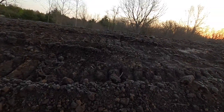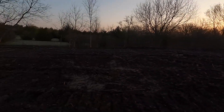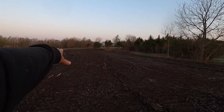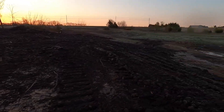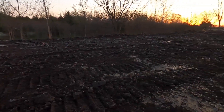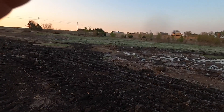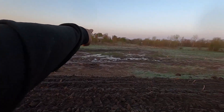I was hoping this stuff would be frozen — it is fairly frozen, not real wet. As you can see, here's the top of the dike — he's already taken a good couple feet off of it. We want to take a good portion back; it might actually be graded where it's kind of lower, but we want to pull probably six, eight, maybe ten feet out up here at the end. Then they're going to push out the pond back here, move all that dirt up this direction, and get all this elevated, kind of coming down to the pond with fall all the way around.